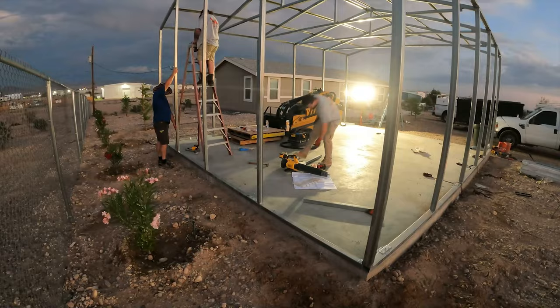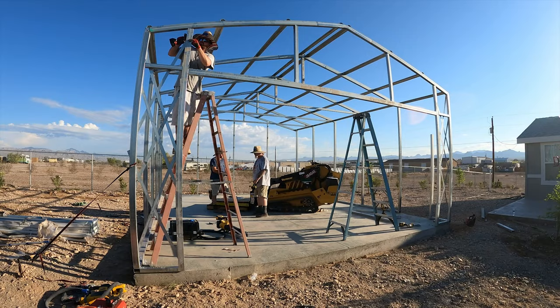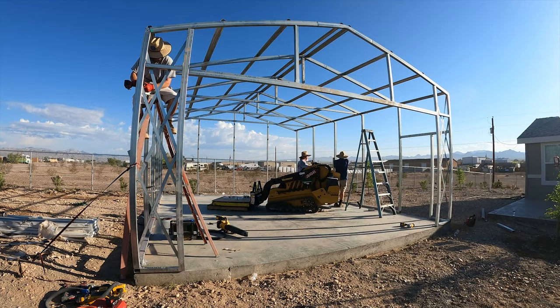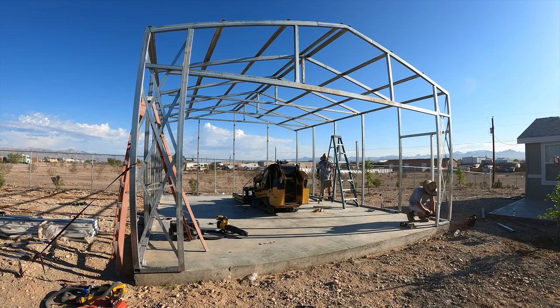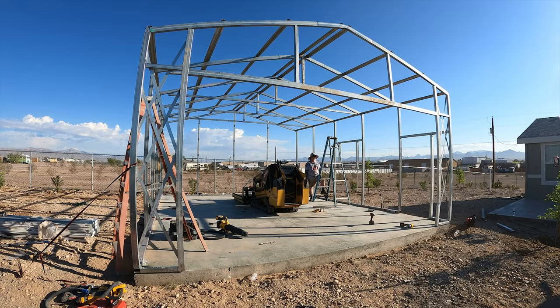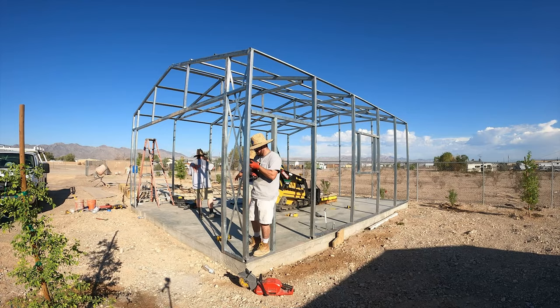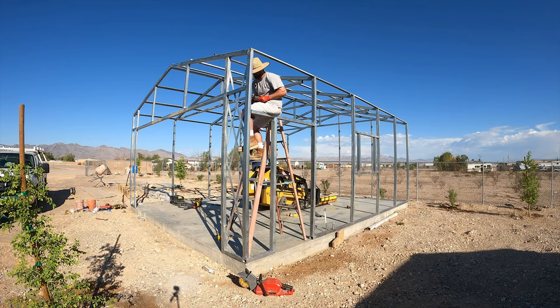Here's the front of the building. We've got a 10 foot eave, an eight foot opening, a 16 foot door, and about two foot returns on either side. You'll notice all these little cross members — those give you lateral structure so it's not going to twist. Those corner bracing members are important. We've also got two hold downs on that two foot area on both sides. Over here is where the passenger door is going to go — there's a small area bolted to the concrete in that corner with four hold downs right there alone.